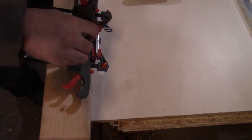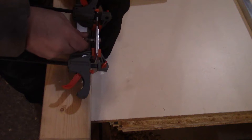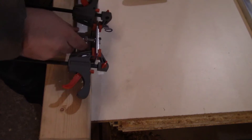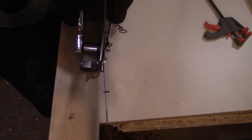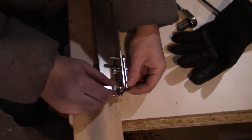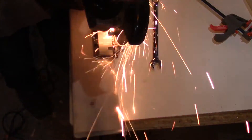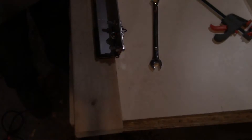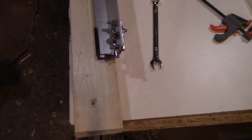To secure this section I'm using nuts and bolts. These holes are slightly undersized to make sure that the aluminum and hinges are bolted together tightly, though I must have twisted this bolt crooked at some point and cross-threaded it. So I left it for now and moved on with the rest of them. I came back later to try and come up with a diplomatic solution, and after a lengthy deliberation with the bolt, we came up with a solution that worked out well for all parties involved.